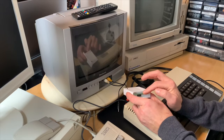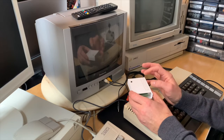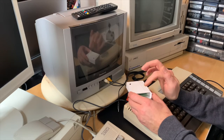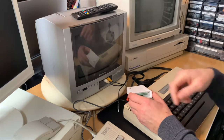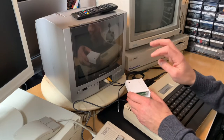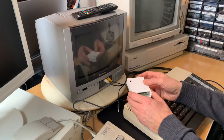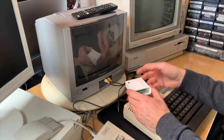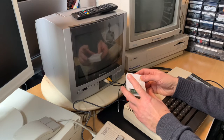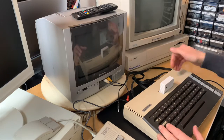So how does this work when you build it yourself? It's a pretty easy build — you have the PCB and you just put the Raspberry Pi Pico on. You have to flash it: hold the boot select button on the Pico, plug it into your PC, and upload the script. Then you unplug it. From then on, connecting it without holding the boot select button registers it as a USB device, and you can use Windows Explorer or Mac Finder to put files on.